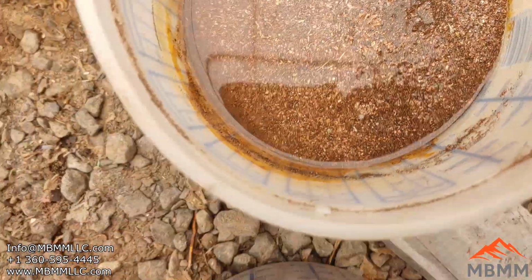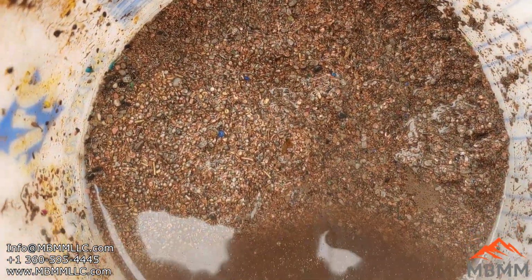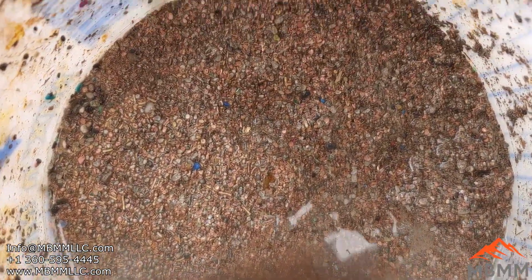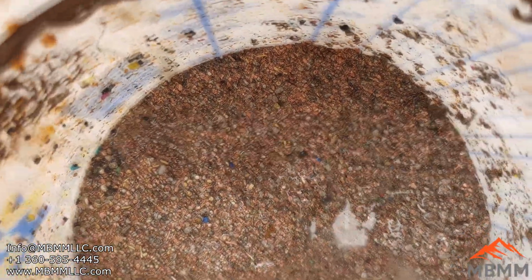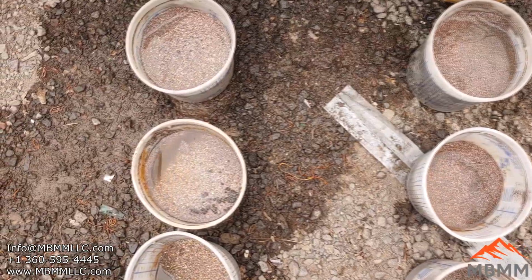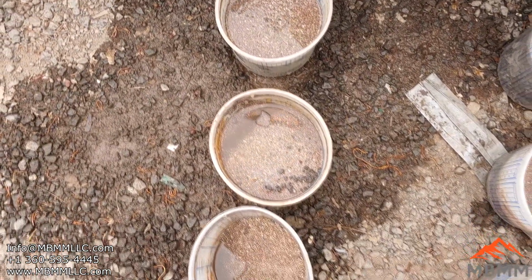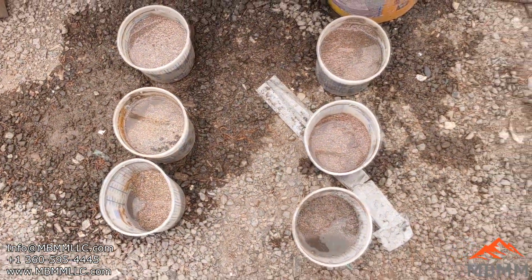And that surprised me. I always thought that it really didn't matter how much material was on the table. Only so much could go over into the number 1. But that's not true. It depends on the characteristics. So if you have a lot of flat, flaky, disc-shaped copper pieces, they'll go into the number 2 and the number 3, and hardly anything will go over into the number 1. And then if you have a lot more gold pins and coarser pieces of copper, they'll end up over in the number 1 and won't go down to number 2 and number 3.